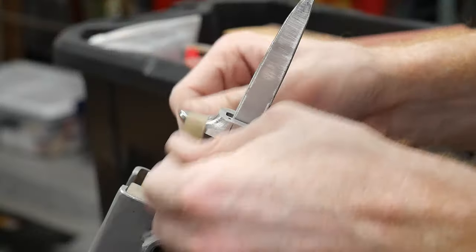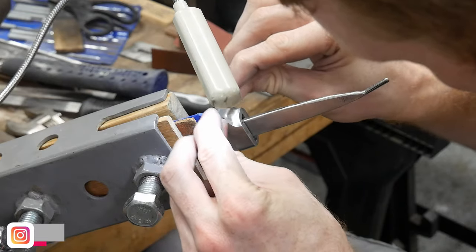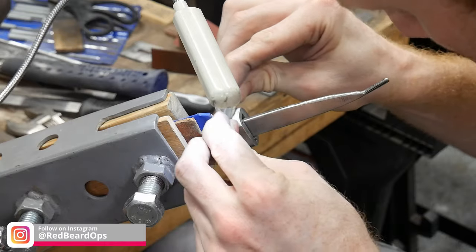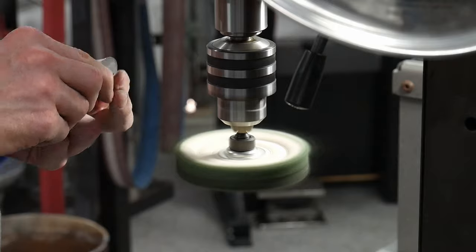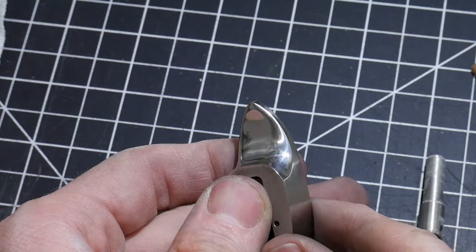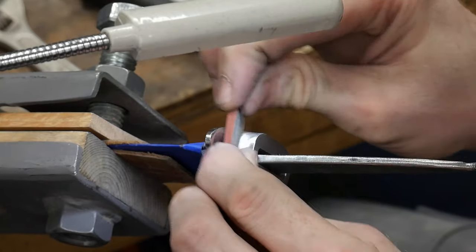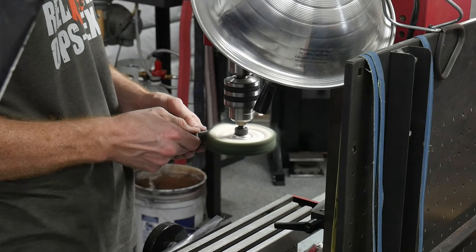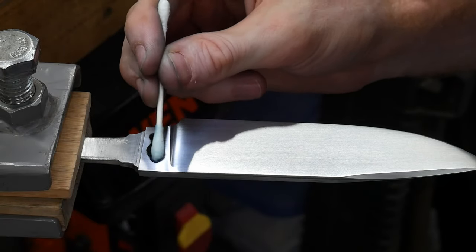To get this guard finished where I wanted it, I spent at least three hours. What I ended up doing was hand sanding the inside section of the guard up to a high-grit finish, then buffing it with green compound. I did this a few times since I didn't like the finish each time — I increased the grit until I got up to around a 1500-grit finish before buffing. I left the sides of the guard satin, and I really like this contrast.